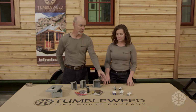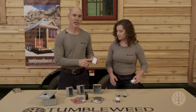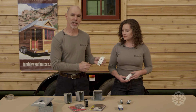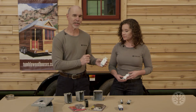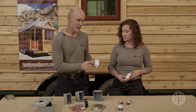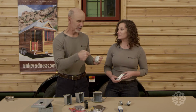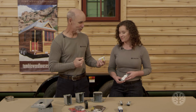You also have options for your receptacles. There are some that have a built-in circuit to protect you from electrocution. These are usually used in wet locations. They're referred to as GFCI. They'll have a reset button and usually a little light on it to tell you that it's working properly. Another feature to some of the modern receptacles is what's called tamper-proof. They will have a little window that closes the entrance so that you can't inadvertently stick a paperclip or something in there if you tried.